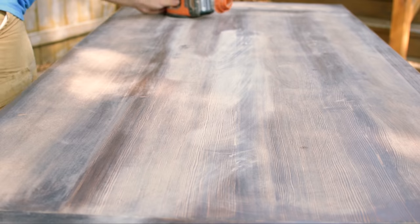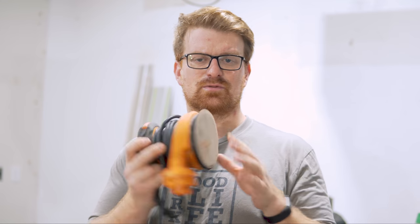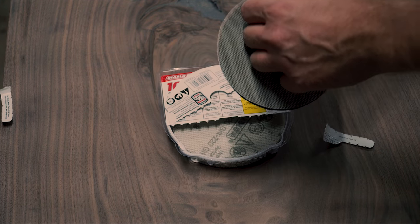At this point you're probably working with dimensional lumber or faced hardwoods that shouldn't be too much of a challenge. I highly recommend a corded random orbit sander to start — the cordless models still chew through batteries a bit too fast to finish large projects. A five-inch is the most common size, and this one I use comes from Ridgid. At the entry-level price point, they're all doing pretty much the same thing — a motor, dust collection holes, and a bag or vacuum hose port.